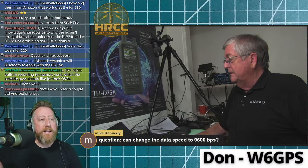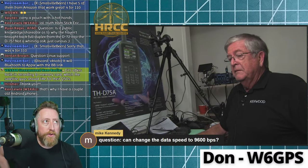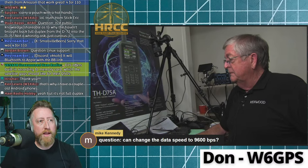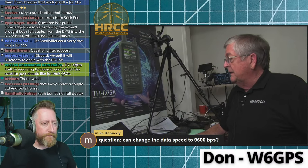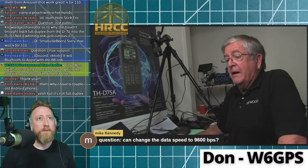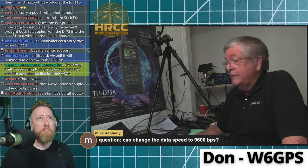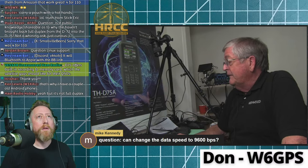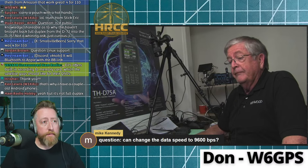Good question from Mike Kennedy. Can you change the data speed to 9600 BPS? So you can do 9600 BPS on 440 and higher, the 70 centimeter frequency. Can you do that on 2 meters as well, now that we have that symbol rate limit removed? Is that something that's possible? Yes, I believe so. And if not, that could be a firmware update. They also use 9600 APRS a lot in the Northwestern United States. They use 9600 baud packet speeds.